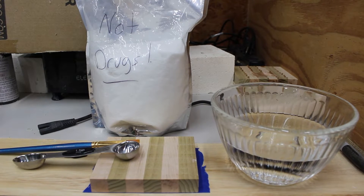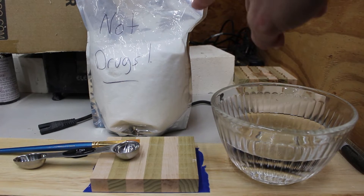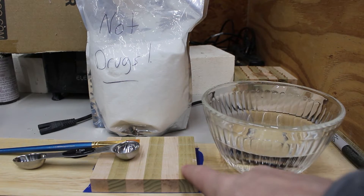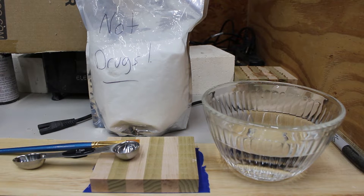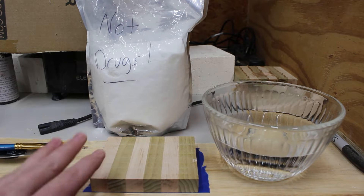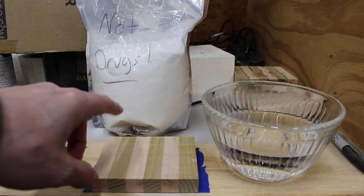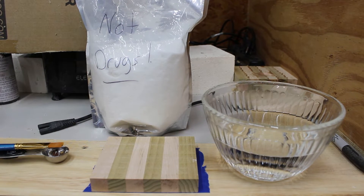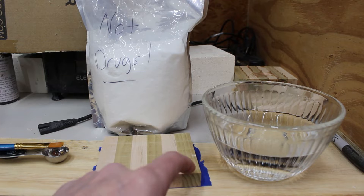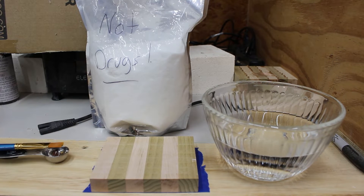We're going to do a bit of an experiment here. If you make a solution of Borax powder — which I like to keep in these nondescript bags — and some water, you can make a solution that you then put onto your wood. When you laser engrave it, it makes the engraving black and not just sort of an off-brown. I want to test this on some scraps of maple and poplar that I alternated and glued up. I'm going to mix up some Borax solution, paint it on, let it dry, and then do two experiments at the same time. The first is to use Borax on the whole thing to see how it affects the wood. The second is to put masking tape over half of it to see if that prevents some burn edges, since I don't have Air Assist.